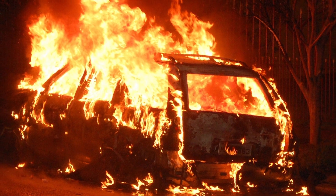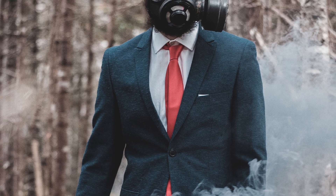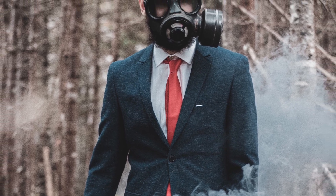Before we get started, a word of warning: lithium-ion cells pack a high energy density, so short circuits, exposure to high temperatures, or damage to the battery can cause uncontrolled thermal events. In addition, when lithium burns it produces highly toxic smoke, so when doing this take every precaution and make sure you have access to the outside should anything bad happen.